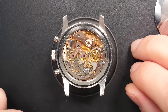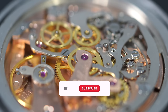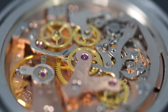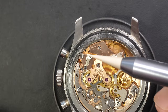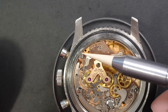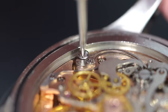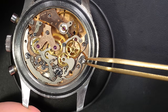Wow, look at this beautiful copper-finish color on the movement. We can see the Venus logo under the balance wheel — the star — and it's actually a Venus 178, you can see the number there. Also, that case screw is not correct — it's not the proper one. Somebody tried a quick fix. You can see the two screws are very different; that's the proper one there.